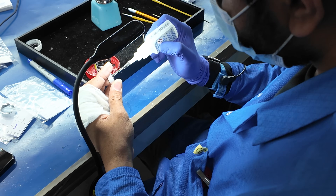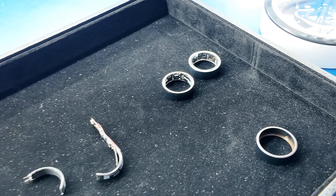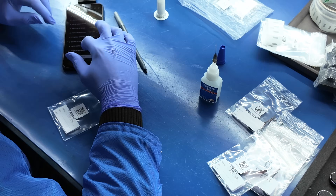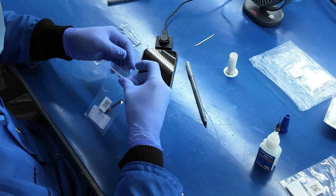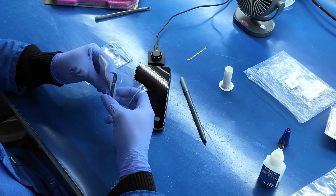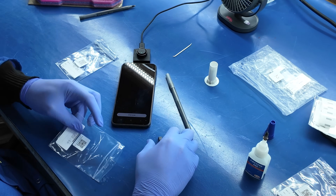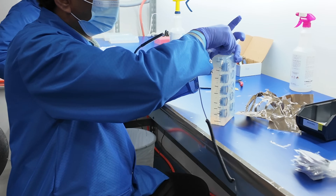The titanium shells are mass manufactured and finished outside of this facility. Now with the printed circuit boards inside the ring, they are mounted to a special fixture which can inspect the functionality of the ring by using a proprietary app on a smartphone. Once it's confirmed that the ring is operating correctly, the rings are then inserted into a special flexible silicone mold.